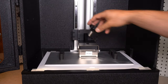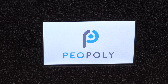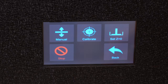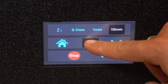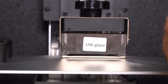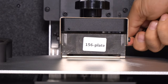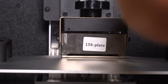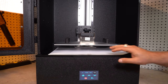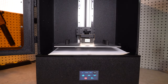I'm going to go ahead and slide the build plate onto the arm and put the screw down to start the leveling process. It's pretty much like leveling any other printer. The first thing we need to do is move the build plate up a little bit, then loosen the four screws on the side of the build plate so it can move and adjust itself properly. You're going to put a piece of paper underneath - this actually comes with the printer - and hit home.